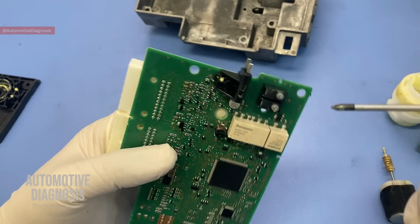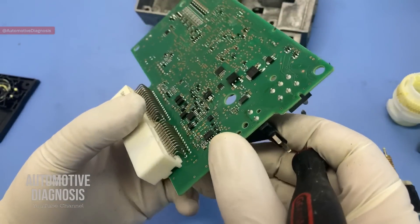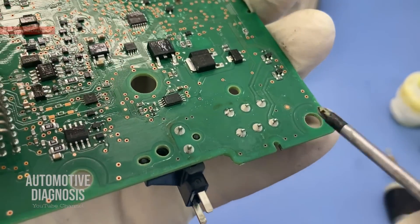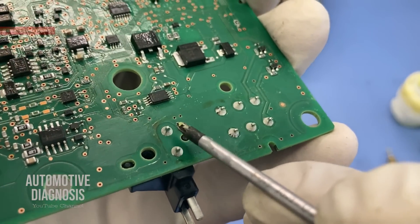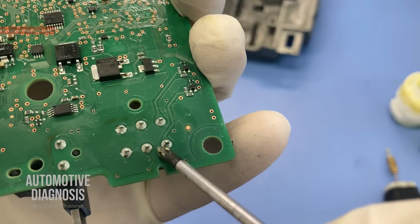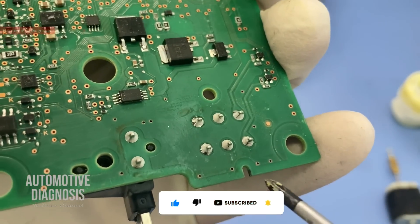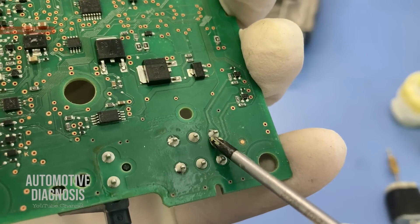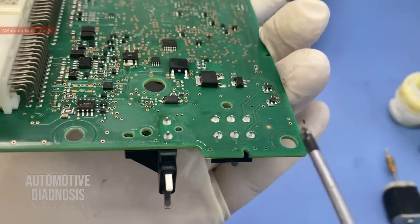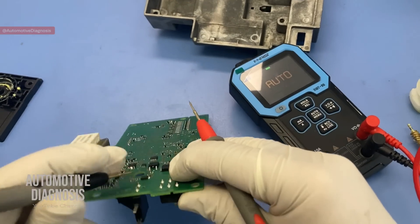The other important parts for inspection are these two. First, this one is supposed to provide positive and negative to the DC motor. You need to check this side of the board to make sure the connection between those components and the board is provided properly. Check the solder between these two — these two are actually for the two pins — and check all six connections here to make sure they are nice and clean. If they are broken, the switch is separated from the board and the start-stop system won't receive information from that switch.